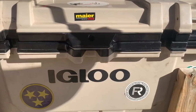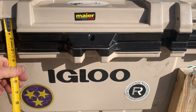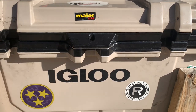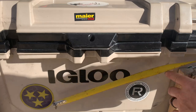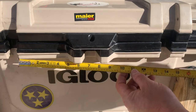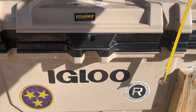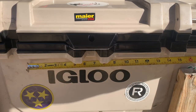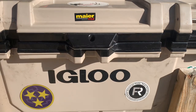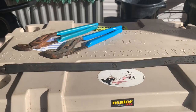Let me show you the next step - we're gonna measure. We're gonna measure from the center of the pin down to the bottom right here, that's roughly four inches. This ain't got to be science - four inches. Then we got 14 inches from that edge to this edge. So you got four, four, and 14 - that's 22 inches. Remember that number.